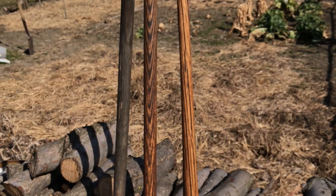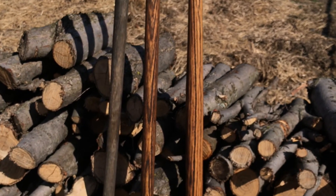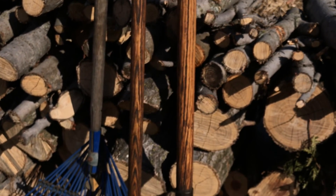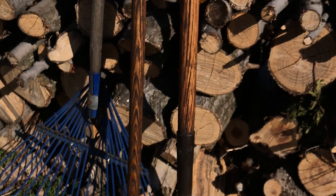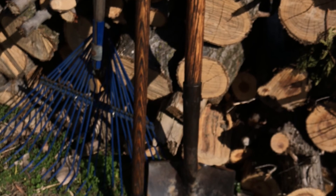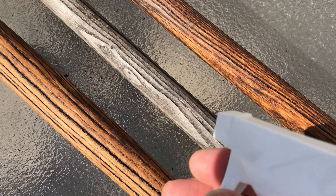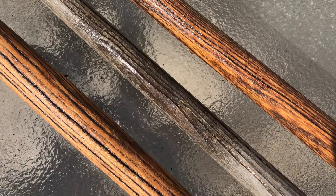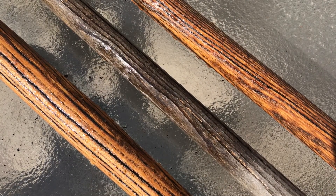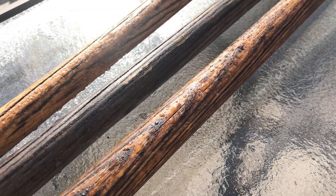Now here are the two tools I recoated along with a rake that I haven't touched yet, just for comparison. I've given them three coats and they're dry now — they look fantastic. The wood has darkened up and they have a very pleasing deep amber color, plus the surface is smooth and they have a real great feel to them. Just to simulate some rain by spraying water on them, you can tell the unfinished one is absorbing it all, but the other two are now protected — the water is shedding away or just beading on the surface. This is exactly what we wanted; it's a great result.